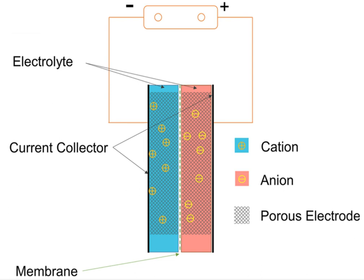SWNTs have diameters ranging between 1 and 3 nanometers. MWNTs have thicker coaxial walls, separated by spacing of 0.34 nanometers, which is close to graphene's interlayer distance. Nanotubes can grow vertically on the collector substrate, such as a silicon wafer. Typical lengths are 20 to 100 micrometers. Carbon nanotubes can greatly improve capacitor performance, due to the highly wettable surface area and high conductivity.